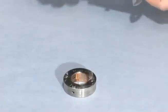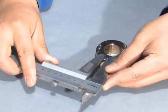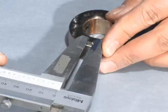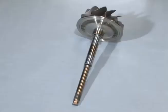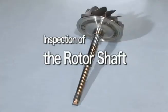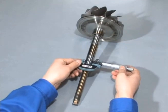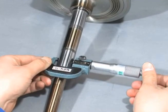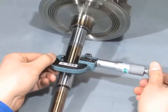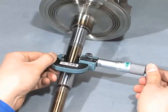The locking pin is attached to the journal bearing. Replace the journal bearing if this pin is worn by 2 mm or more in width or broken. Measure the outer diameters of the sliding parts. If the outer diameter of the sliding part is smaller than the adjacent outer diameter by 0.02 mm or more, please contact Mitsubishi Heavy Industries.